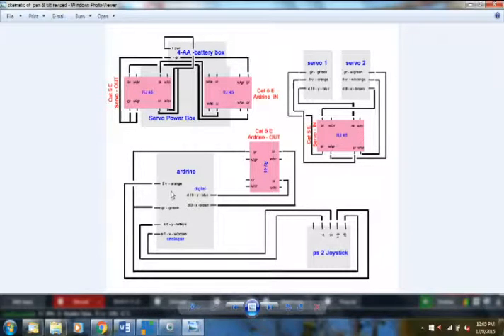The green wire comes out of the joystick, goes to the Arduino board, and into the ground header pin. The next pin is the 5V power: it comes out of the Arduino board's 5V pin as an orange wire and gets soldered to the joystick's power pin. The X pin feeds into the Arduino board and uses the white-brown wire. The Y pin uses the white-blue wire — I chose blue and brown for signals to correspond with the servo motor wiring.